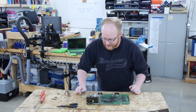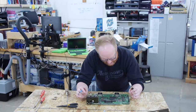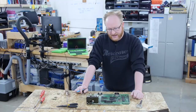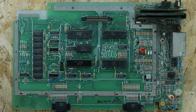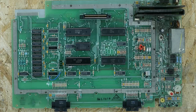Let's see if I can figure out what these chips are without looking them up. This is going to be a mask ROM — that's pretty obvious because it has a reduced pin count. It's actually more simplified than I thought. It's going to have a 6502 CPU, probably a Pokey, a PIA, and an Antic and television adapter chip. But there's only four, so maybe they combined them into one chip. Over here, this is clearly the RAM. And more lovely bodges. Looking at this board, the fact that there's hardly anything on it but the board is the size of the moon really stands out.